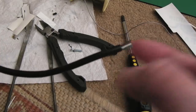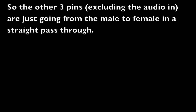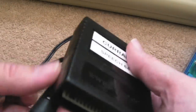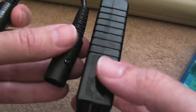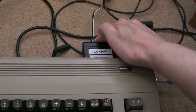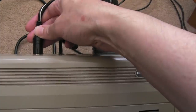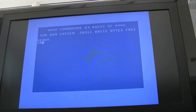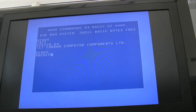Remember to put the housing on before you solder the wires if you've got something already fitted on the other side. So we've gone from testing it with Allison's amplifier box to actually using one of Allison's connectors — Allison's featured a few times in this video. I'll connect this up now — as you can see it's held together well. I've had it in and out of the C64 a few times. Plug the AV lead into the back of the C64 and the normal AV cable into the pass-through, switch it on — and it's working fine.